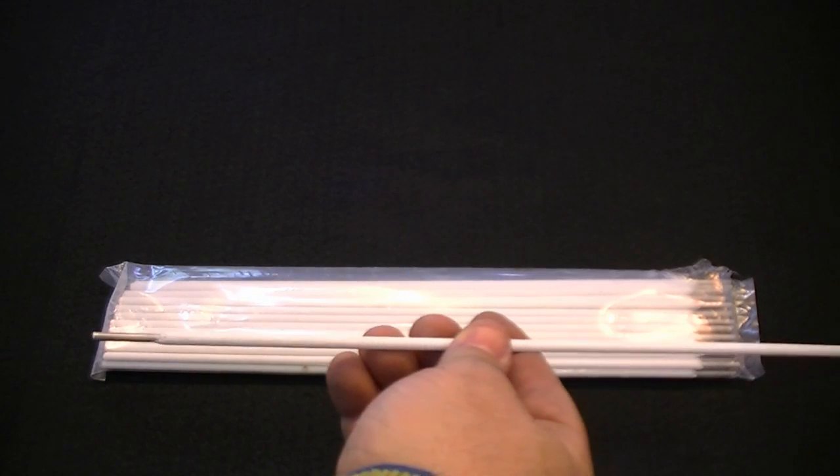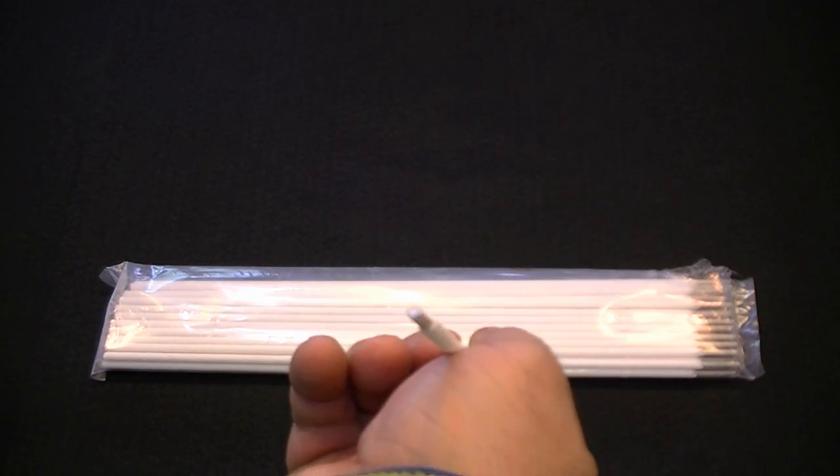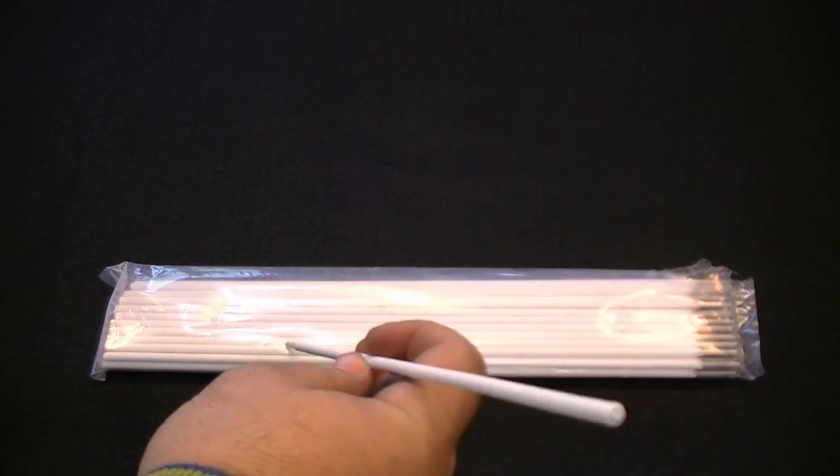The 5 pound containers are individually wrapped into 1 pound packages, sealed in plastic. The flux found on aluminum welding rods will absorb water from the atmosphere. Some electrodes will not survive outside of the packaging for extended periods because of their hygroscopic tendencies. These 1/8 inch electrodes are 14 inches long and coated with a light flux.